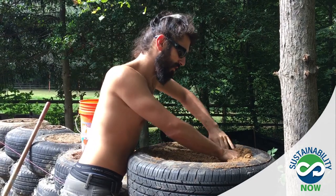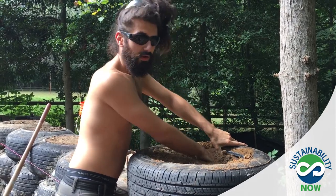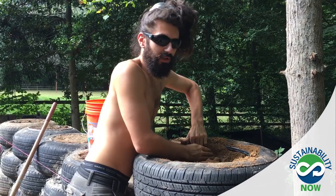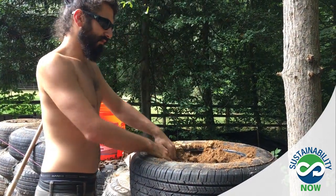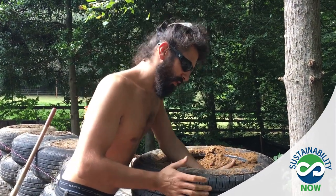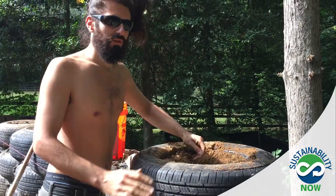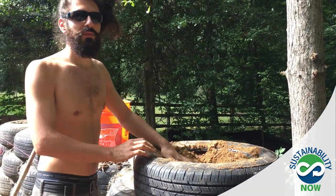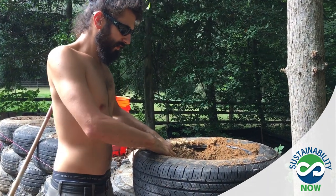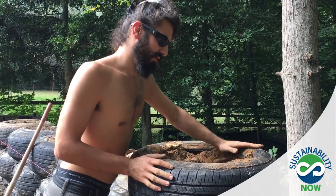So normally you have houses that are made where it's essentially just a box with systems in it. A box that gets warm during the day and cold at night, and the way that you regulate the temperature is by burning fuel oil or using electricity in the form of air conditioning. So the difference with an earthship or any rammed earth structure or any adobe or stone building is that that stone is going to be cool in the summertime, and in the wintertime it is going to be warmer. So it's a combination of techniques, but that's why we're ramming the dirt in the tires.